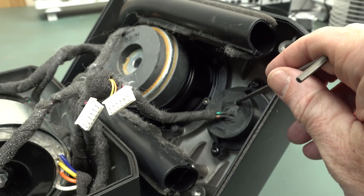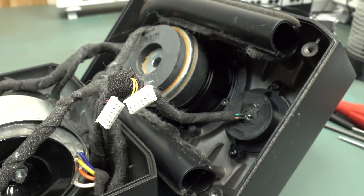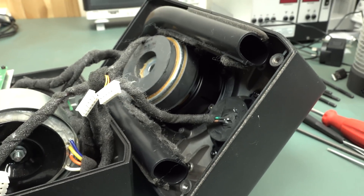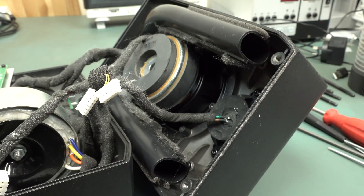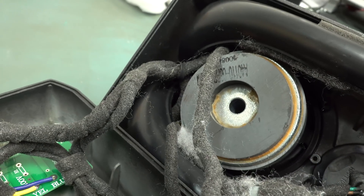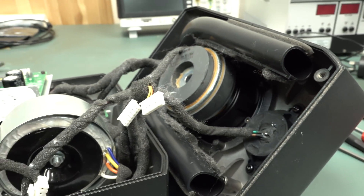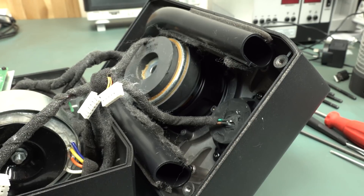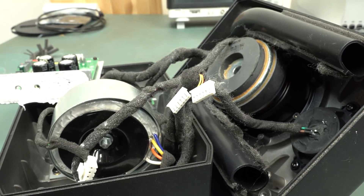You can see the sealing on the back of the tweeter wires down in there. That woofer is nice and large - almost takes up the entire depth of this thing. It must have a decent throw on that cone. I like the acoustic design. They've got two separate ports with big, long, curved tubes which look like big exhausts. Focal are a reputable high-end speaker manufacturer, so I'm sure they've done the measurements on the acoustic design. Its performance is really quite remarkable for a little four-inch design - it really puts some larger five- or six-inch jobs to shame.